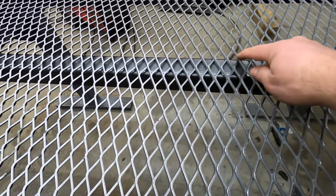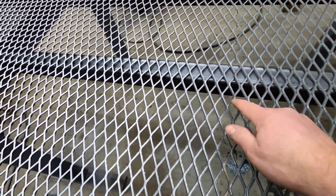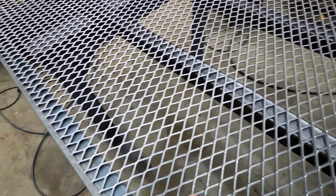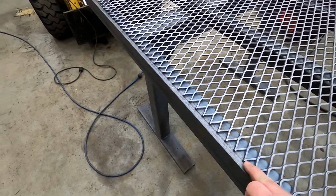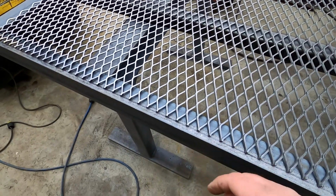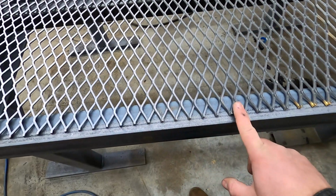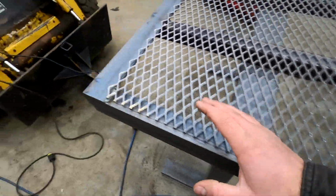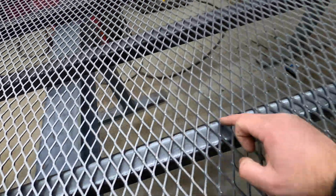So what we'll do is we'll just tack weld all the little joints. Put a tiny little bead of weld that'll hold it together. And then what I'll do is, I like to weld every single joint right here. A lot of the trailer manufacturers, when they do their gates, they'll weld like here and here and here and here. If you've been watching my channel, you know I hate that stuff. So what I like to do is go through and weld every single one and every single one down here.